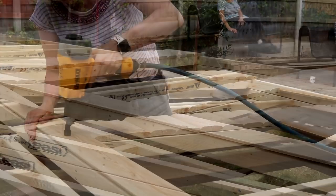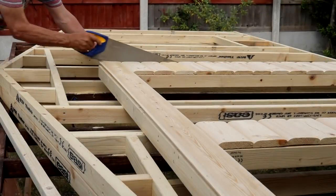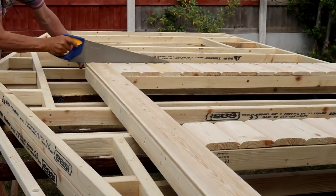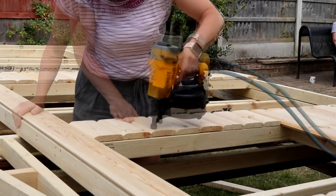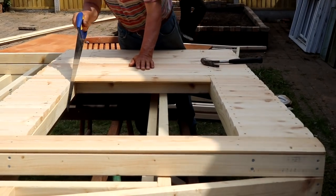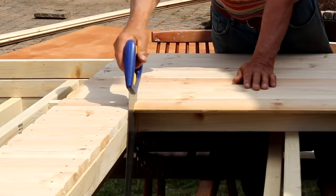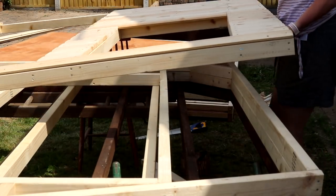After slotting it in, I nailed down the end. Before I cut the rest, my dad cut down the overhang with a handsaw. Then I worked on nailing the rest of the shorter pieces while my dad trimmed the excess around the window. We would have used a flush trim router bit here, but we set it aside as my husband was using the extension lead on another job.